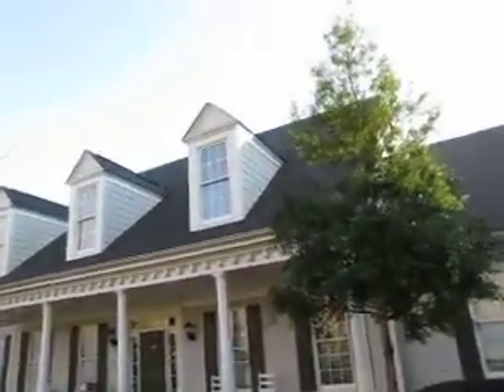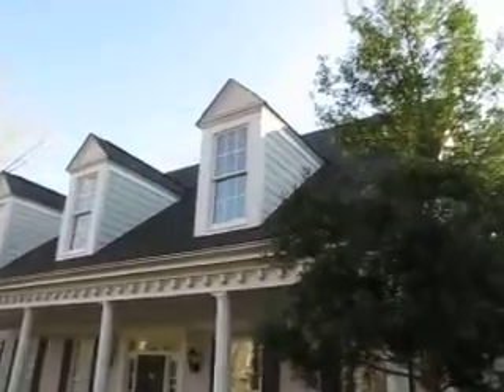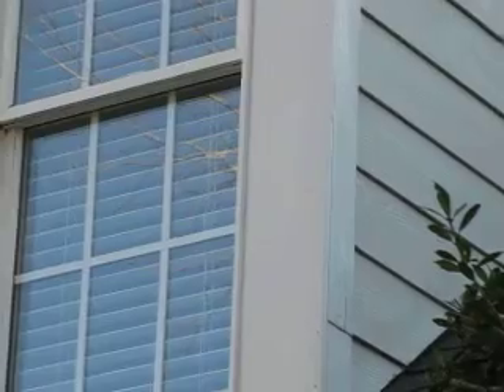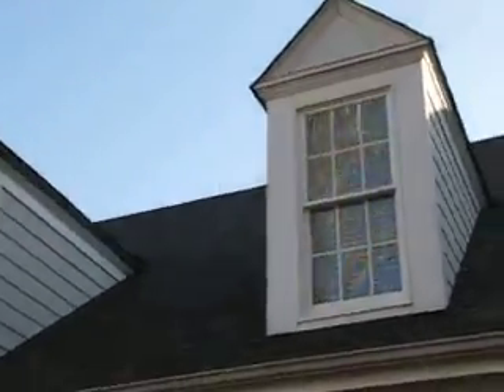I'm back with new batteries. On your front dormers, you can see the lines — that's usually a telltale sign that something's not really happy up there. Engineers call that kind of stuff 'activity.' At an absolute least, we should shove some caulk in that crack and get two coats of Sherwin-Williams Super Paint.